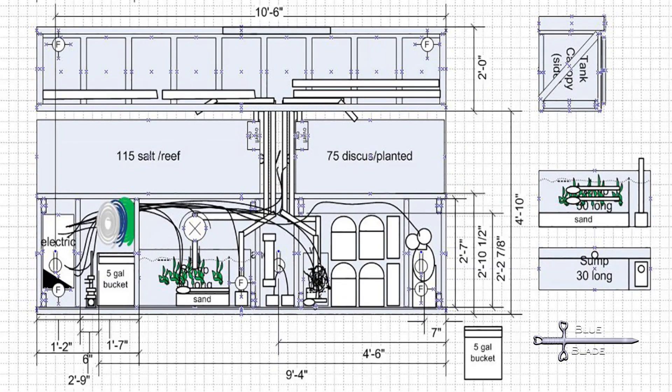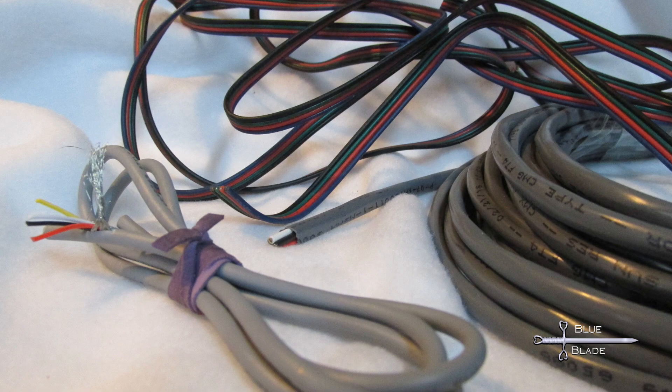I need a 7.5 and a 6.5 foot line, and the waterproof sensors came with three feet already attached. You need at least three-conductor cables for these runs. There's very little current, so headphone lines work great — that's what I'm using. Cat 3 or phone cable can be a good option also.